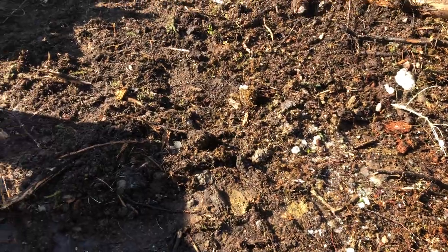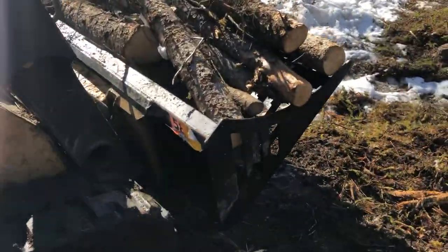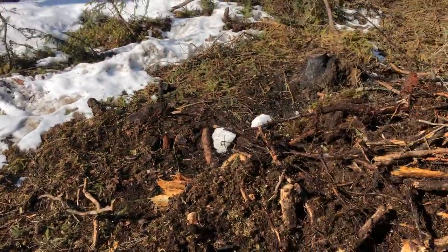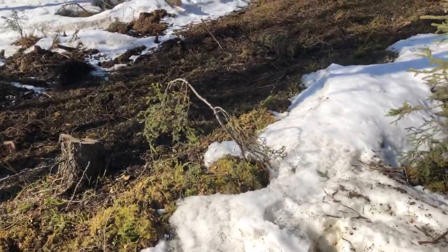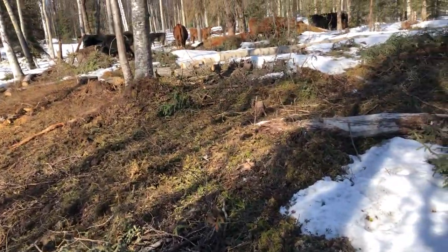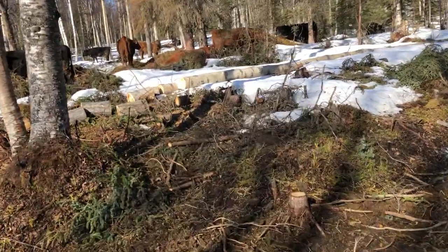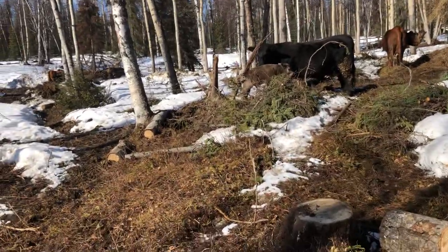This is still ice — I'm right on top of the ice, which is ridiculous. But you can see the almost complete lack of topsoil here; it's maybe an inch thick. The skeleton bucket is going to allow me to overturn all that moss, get all the little stumps out, get all the wood debris out. Many fires over time will need to be burned, and then I'll spread the ash around the soil, which will help with the acidity — adding wood ash will help alkalize it just a little bit.